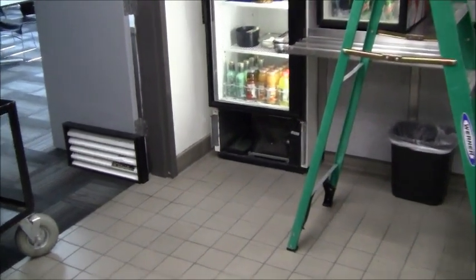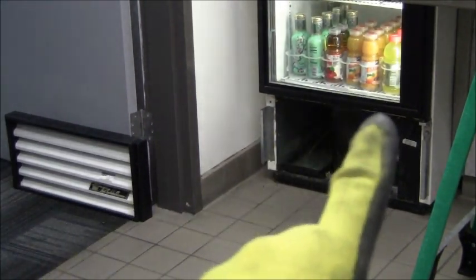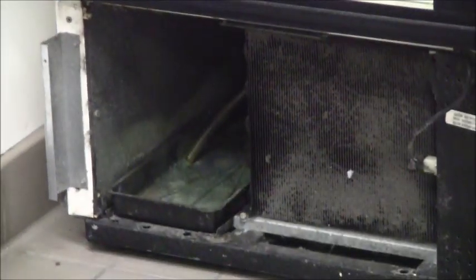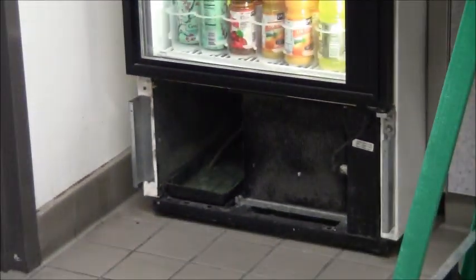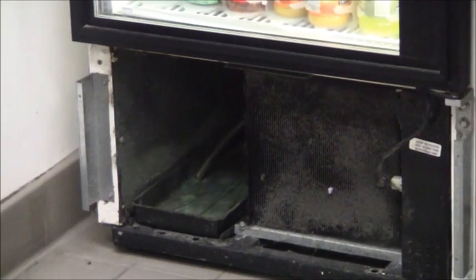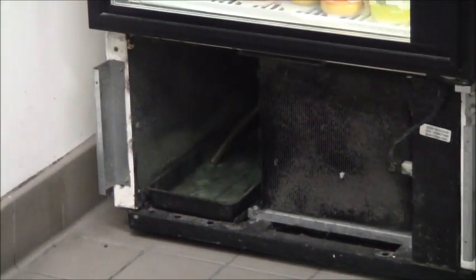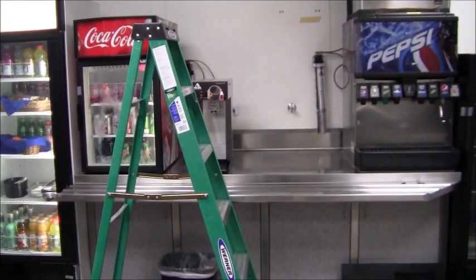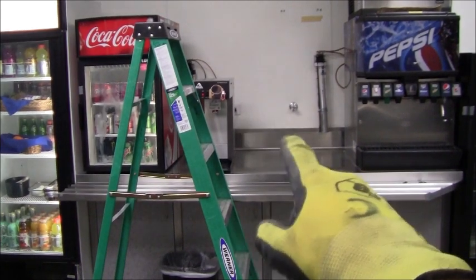I took the door off of the True — there's the door and there's the coil right there. You can see how dirty that is in this picture and I haven't washed it down yet. The tray was sitting at an angle and I had to lay it flat — it's supposed to lay flat. That tray is there with a tube so that any water that builds up in the evaporator section drains down into it, and since warm circulated air from the condenser flows over it, it evaporates off into the atmosphere. You can see it's dry, so no issues.